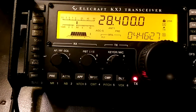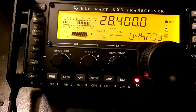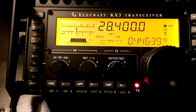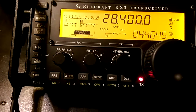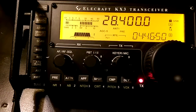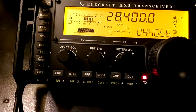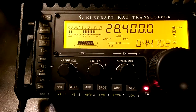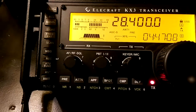NVIS is what I'm interested in — fill in that skip zone. There's a lot going on on 80 meters. I can listen to quite a bit of it; I just can't get out. I talked to a guy over in Camas once, and that was about it on my 15 watts. I got into a net — something like a late-night net where all they try to do is make 80-meter contacts — and I made it to net control, but the guy within five miles of me couldn't hear me at all. I was using the 40-meter antenna and trying to load it up.